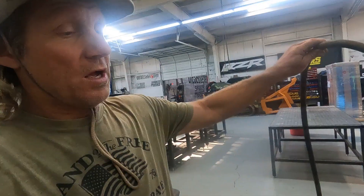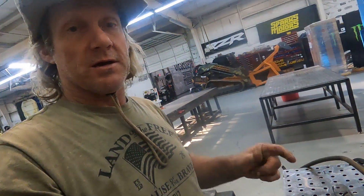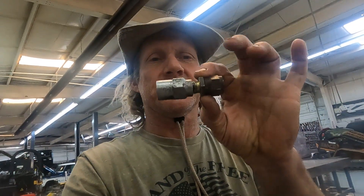So one of the lines I've got here that came off the forklift is old and it failed. I did look at it carefully, and apparently the military put on what you see here — separated pieces — which are what's called field replaceable hydraulic fittings for the ends. A lot of different names: reusable, field-installed fittings. I started looking at all of my equipment and found that a lot of the older equipment had reusable fittings.